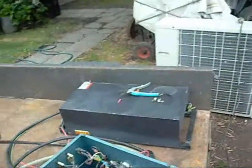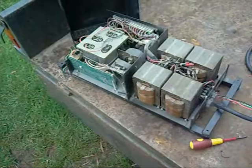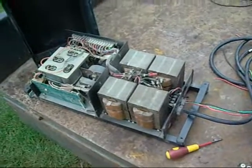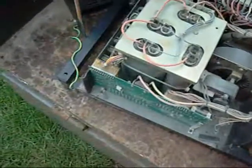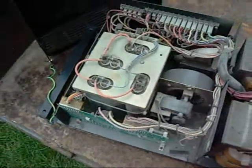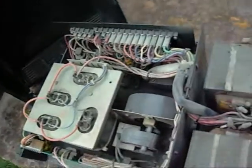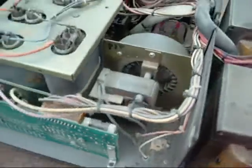25 amps on single phase, it's going to be a push. That is one serious power supply for one lamp. It's got four ballast transformers, four capacitors - I think they are 10µF 1000V 60Hz caps. There's a cooling blower in there. I'm guessing it's actually a blower from one of these - the one that's melted - and that's its replacement, which is very well used.